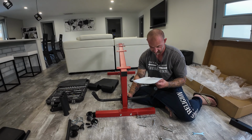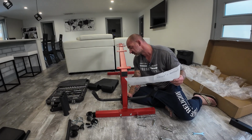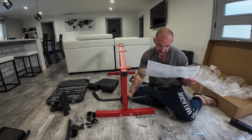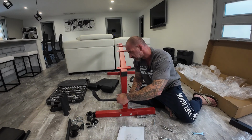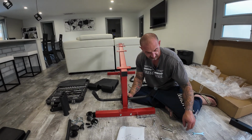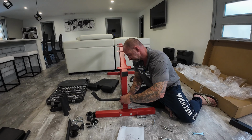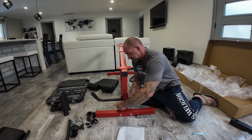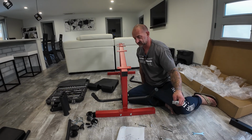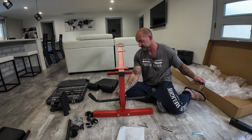Number 3. Let me see. Yeah, but that's what they want, because you have a lot of extra room. You can technically put another number 3, 6. You could put another nut on here, so they should be, so 5 millimeters shorter, I think, will be an ideal length for this. But this is the only place where the longer ones are technically considered, so I'm guessing they figured, since you're screwing, you have 2 plates plus the frame, then you need a longer screw, but you actually don't.